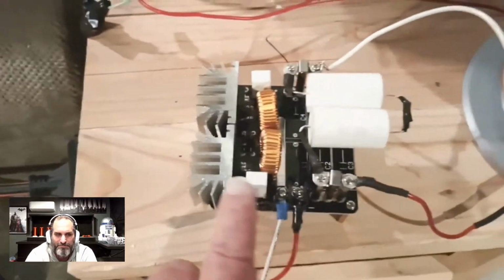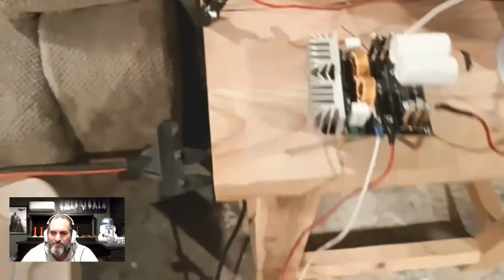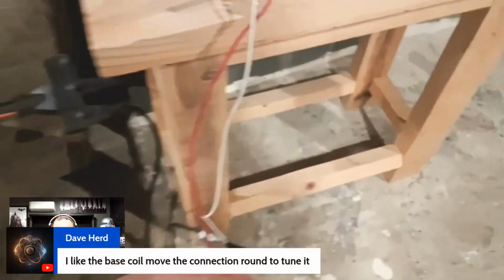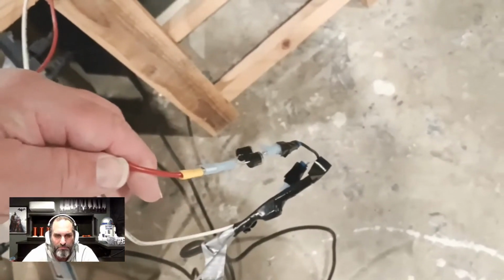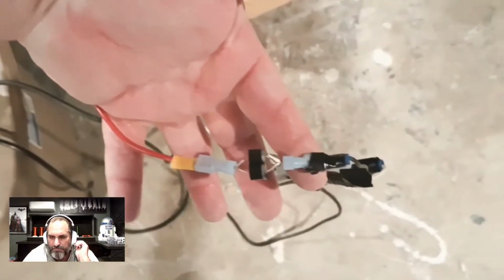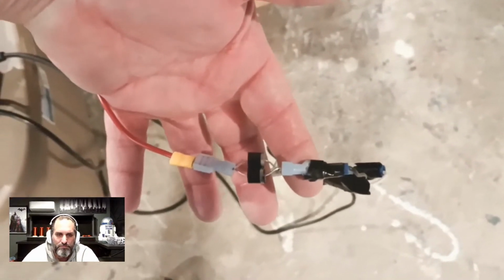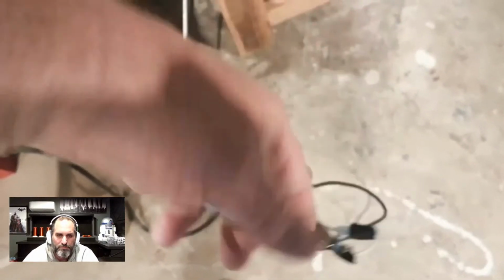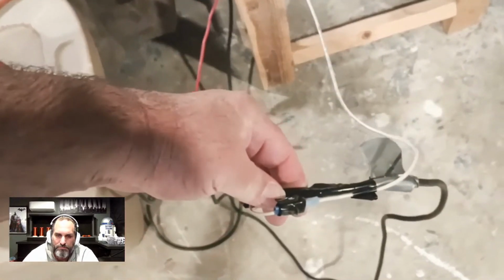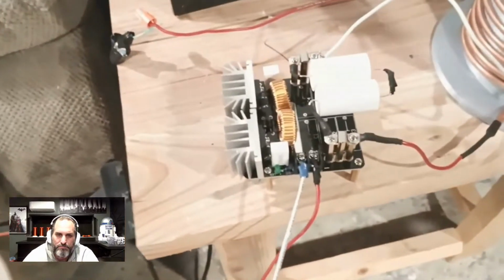So it runs right here. I'll show you the ground from the number 2 goes right here. It goes into ground from the wall. And then right here you can follow the cables along. Here's how we're getting our half bridge on the AC side. And show you this right here. It looks wrong because the diodes are backwards, but it's absolutely right. This is the negative cable going in. And this one is the positive, and yes, it does seem backwards, but it's 100% true. It goes in just like that.